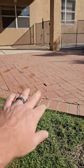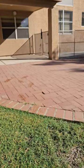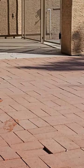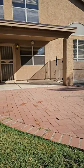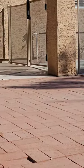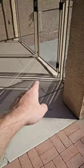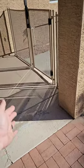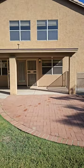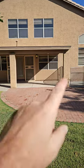There's some more settlement of the pavers in the back from excessive moisture. We have some settlement right around that column as well — you can see the concrete dip down in that area. The crack starts right there and wraps around — that column has actually sunk down a little bit, forming a circle crack all the way around it. If we step back and take a look at the patio surface, it has actually dropped a little bit from a distance.